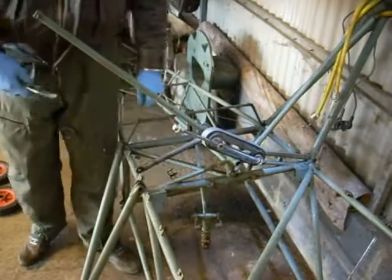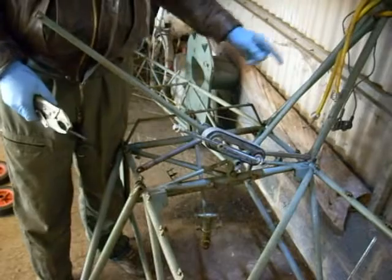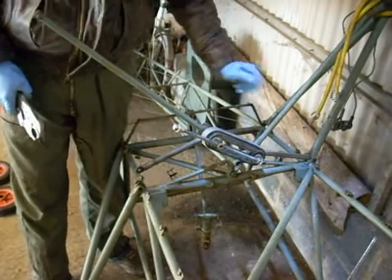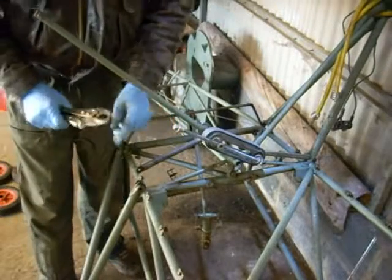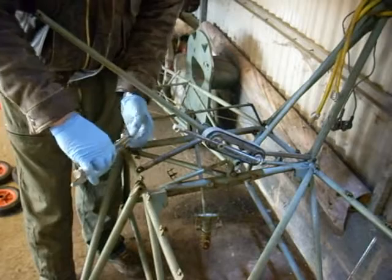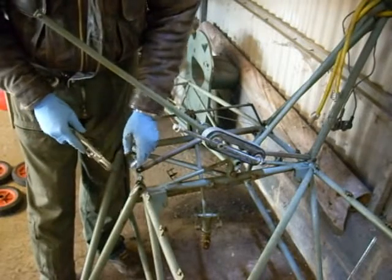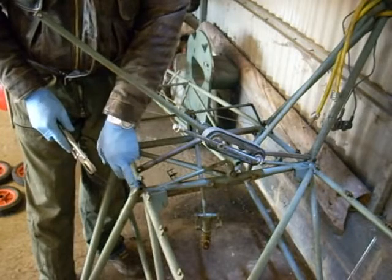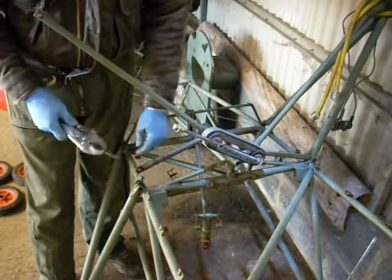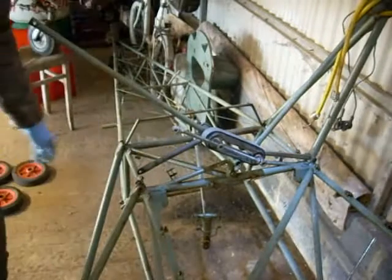Whilst you're in here, by the way, and you've got the load off of the undercarriage and the aircraft is safely trestled, it's a good time to think about taking these bolts out to A, inspect them, and B, lubricate them. Where this eye goes through the bolt, there shouldn't be any relative movement, so it's not as if this eye is going to saw its way through the bolt. However, in theory, the bolt should stay stationary in the lugs here and pivot through here. Sometimes it will, sometimes it won't. It might even be worthwhile just thinking about putting new bolts on while you're there.